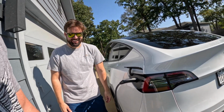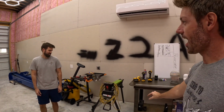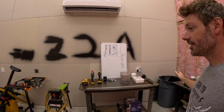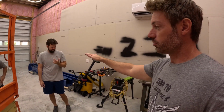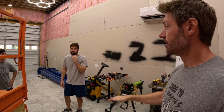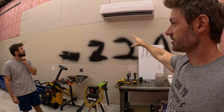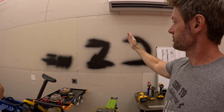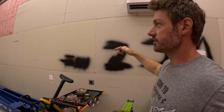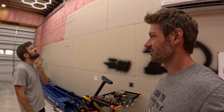It's perfect. Okay, everything we knew about drywall in 3 seconds. You want to put your drywall 1/2 inch off the ground. If you're like me, I did that over here, and then the garage floor was supposed to go down 1 inch that way, so said the contractor. Actually it goes up, so we hit the ground over there. Probably gonna have to trim that later. Screws, 16 inches. So you got your studs this way, but then also up and down, 16 inches, so it doesn't fall off the wall. And is that everything we know about drywall? That's a lot of screws.